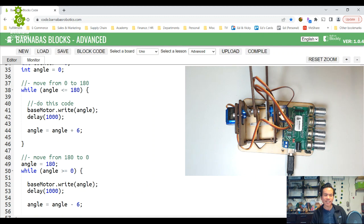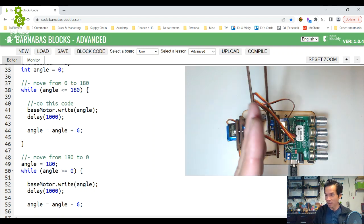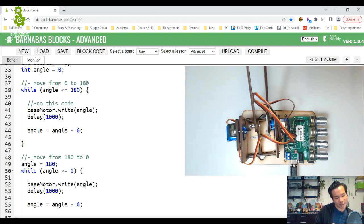I tried that, and it actually didn't make it better. What happened was that the servo motors got more powerful, but I still had the jitter issue. So I think if you overpower it, and then you add on the inertia where it's trying to stop but can't quite stop, and then it overshoots, it could actually make it worse. And then as I experimented, I found that there were certain angles, and I think you saw from our example, there are certain angles where it happens more.